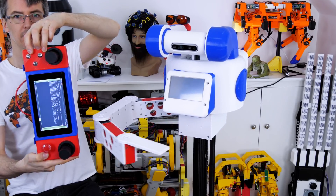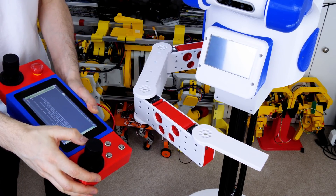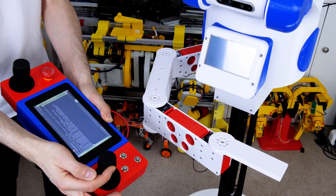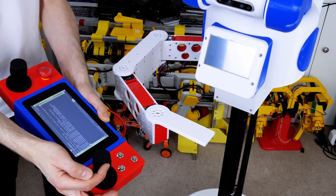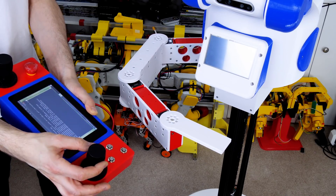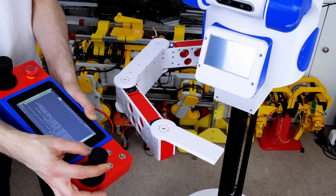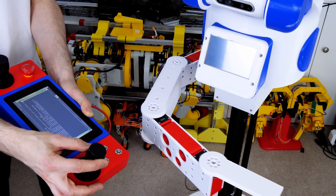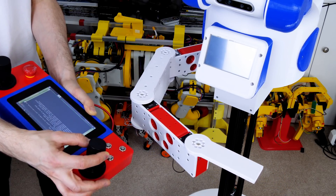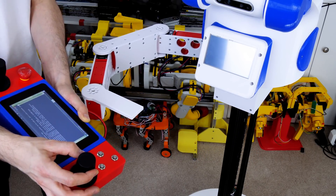When the arm unfolds it goes to the kinematic position set by the sticks. Those sticks are analog and also contribute to an accumulator variable the same as the linear axis, so I can jog the arm around by moving them — the further I push them the faster it goes, because it adds more to the value on that cycle. That means I can make very fine movements and move the arm very slowly if I want to. We get quite a wide range of motion, and of course those sticks mix together so we can move around in a circle, which seems like a pretty good test of the range of motion and the robot's joint capabilities.